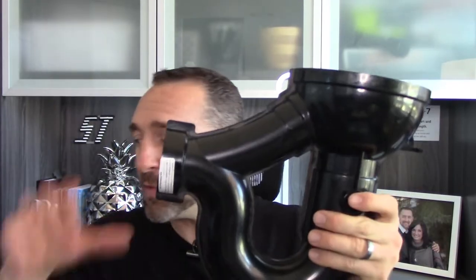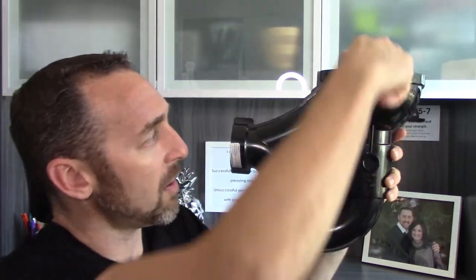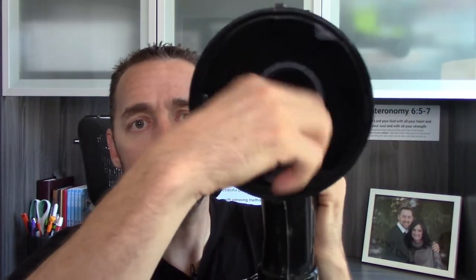Back to the floor drain itself — if you've got a clog in the line somewhere downstream from the floor drain and the floor drain isn't draining well, they've got this extra thing called a bypass or a clean out hole. The idea is that it's kind of difficult to take a drain auger and stick it through the trap — this is a plumbing trap, just like any other fixture has, and it's there to prevent sewer gas from coming into your house. So you've got this extra thing that goes over the trap so you can bypass the trap entirely. All you've got to do is remove your clean out plug, take it out, and now you can stick something in there — you can bypass your trap and take a drain auger to clean out the drain that way.